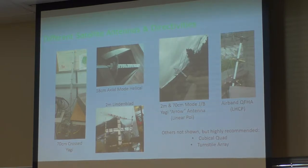As long as you match the clockwise or counterclockwise of the way that the radio waves are coming at you, and that's just a function of what antenna is on the satellite, then you don't have to worry about that. You lose like 3 dB, but then that's it. You're always pointed the right orientation. So that's a very easy to build antenna. It's in the Amateur Radio Satellite Operator's Handbook that W0TLM puts out. There's plans for that. Works pretty well too. It's nice wide bandwidth.